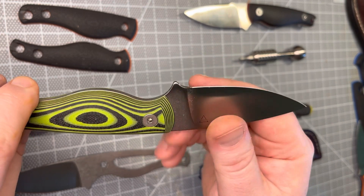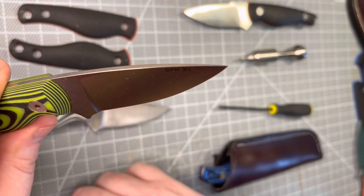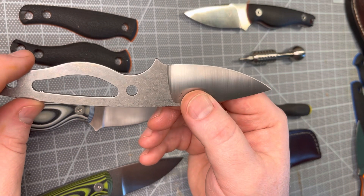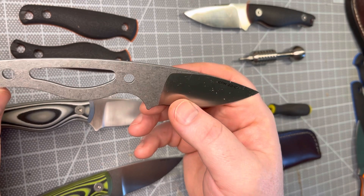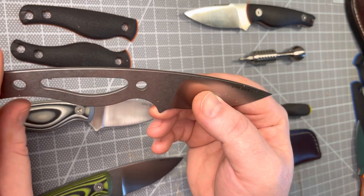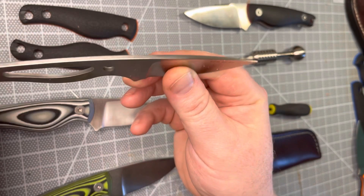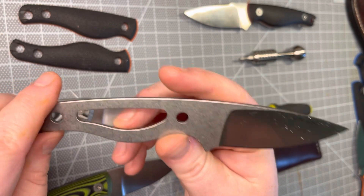These are small batch, and there are some really interesting steels coming up. I wanted to talk a little bit about the way the blade is produced and how it differs from a custom. On all my models, even if I'm only making a one-off or two-off, I'll still have it laser cut or water-jetted first, because then I can repeat it if I really like it. Then it comes back to my shop and I clean up the perimeter. That's a step some knife companies don't do, but there's just a little bit of kerf and it bugs me enough that I want to get rid of it. So I clean it up, and there's a little bit of tolerance and variation in there. When I clean it up, I send it out to heat treat.